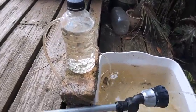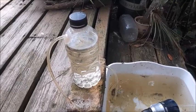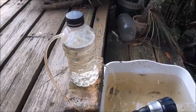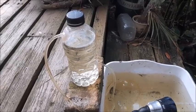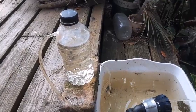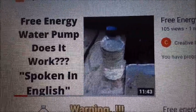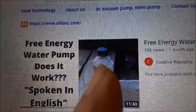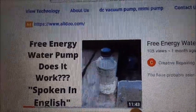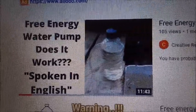I think we can conclude at this point that this whole thing is a sham and there's no scientific way that this could possibly work. Certainly a siphon — you can siphon from a higher level body of water to a lower level body of water, and whether you go through a tank or just use a straight hose makes no difference. One of the things you'll notice about many of the ones on YouTube is they'll flow for about 10 seconds in their video, but the video doesn't really show you if it continues to flow. If you loosen the air vent on the top, then naturally it's going to flow the water right out to the lower part of the drain. In many of the other videos with 55-gallon drums, all they have to do is have an air vent on the top and the thing will basically keep running until the drum is completely void of water.